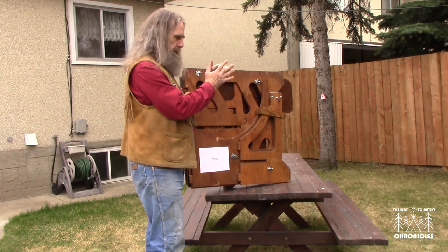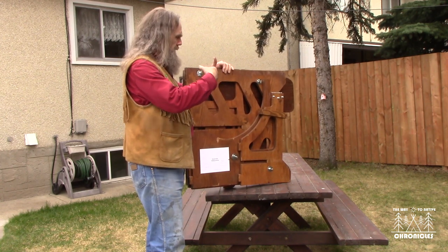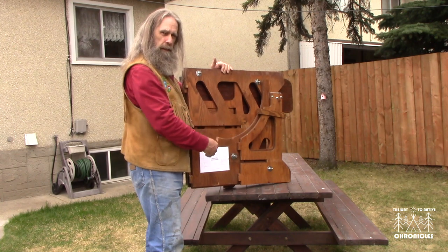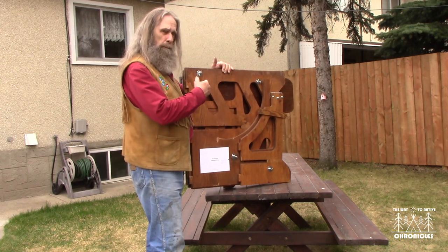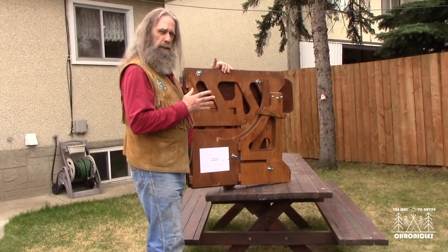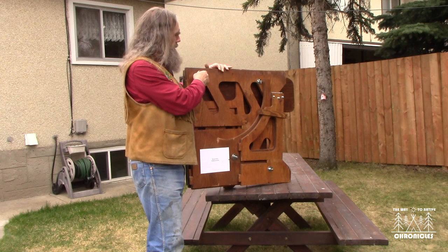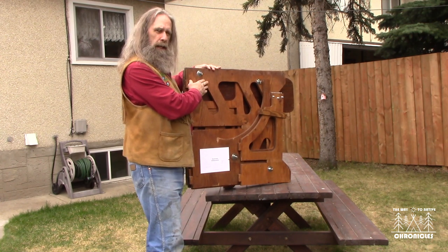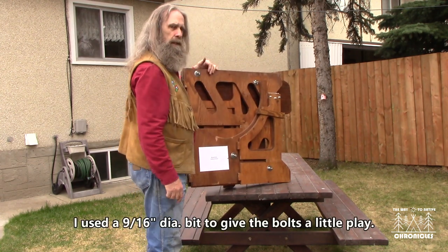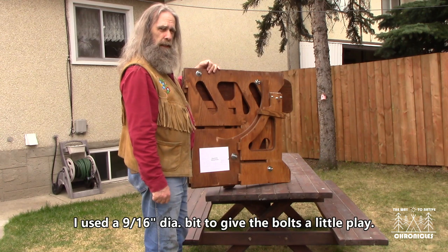I would just take the pieces, lay them on top of each other, and holding them in place, take a long drill bit and run it all the way through all the layers with it sitting in place. That way you're for sure going to get the bolts and holes to line up when it goes through. Because everybody might build it a little bit differently, and if you just go off measurements, really, you don't want to have measurements even on the plan for this. It's just the locations here, there, there, and there, which you'll be able to see, and you can just eyeball that through. Actually, it's probably the best way. You're just going to have to lay the pieces together to do this.